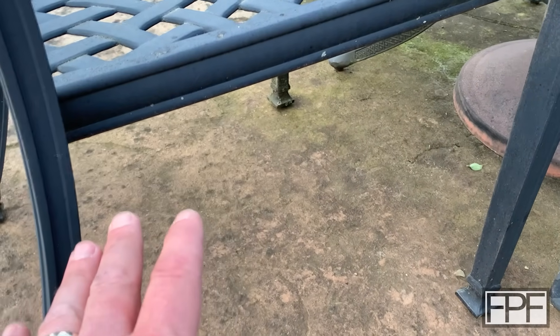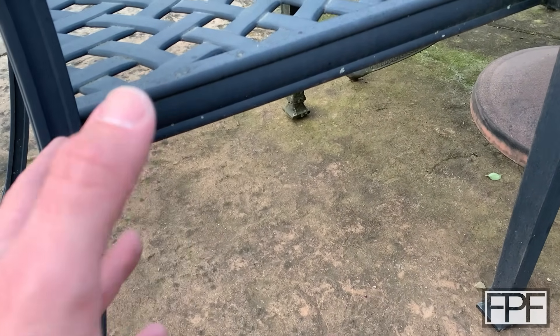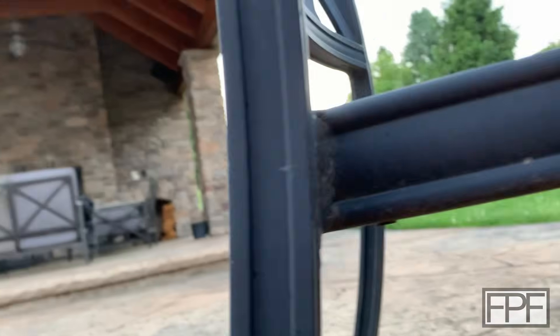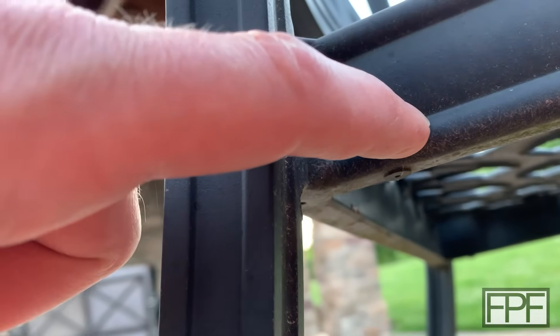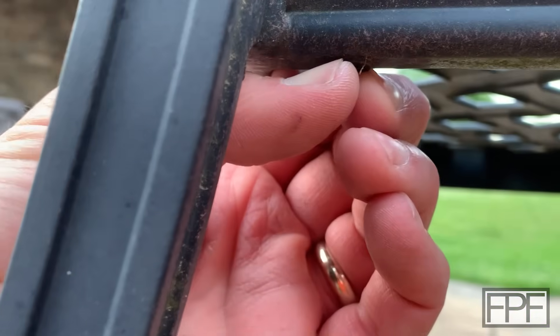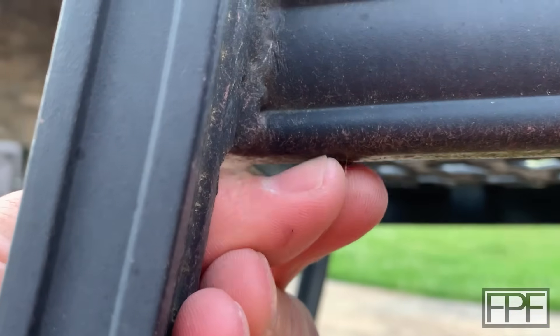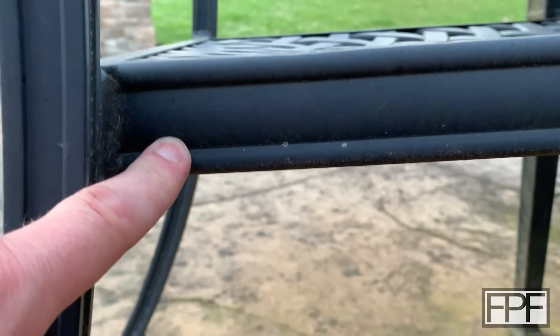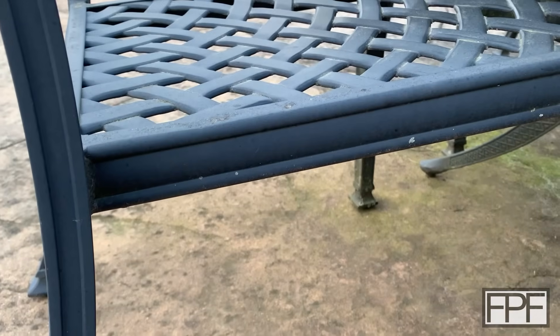This next one comes in at the six-year mark. It's PLA, though it's also really hard to see. There are small drain holes in the underside of these outdoor chairs, and wasps were going into the chairs and making nests. I basically made little plugs for those holes with a much smaller hole in the middle, and knocked each one in with a small hammer. I don't think that one is coming out - it's a tight fit. To be fair, this one doesn't really see a lot of sun, only reflected UV, but it's just plain little PLA and yeah, they're holding up just fine.